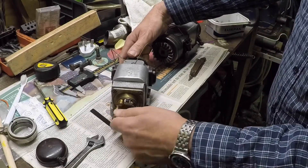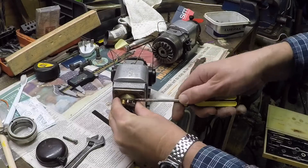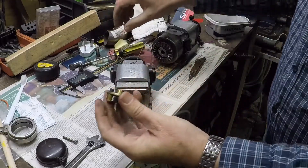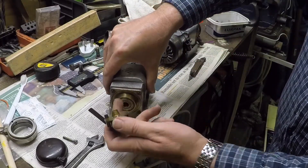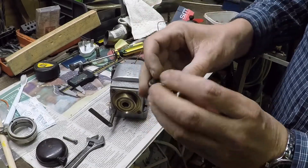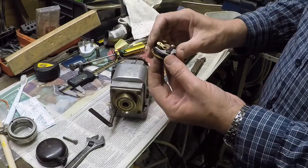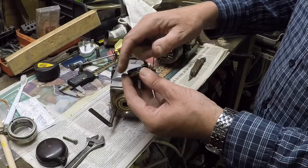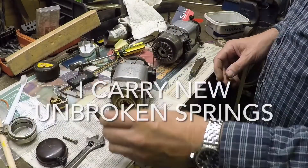You just undo this little centre screw, pop the bolt out, and if you get a screwdriver — a little taper drive — it doesn't need much force, just enough to get behind. There we are — that all rotates. There's the brush that runs on there; the ball race is right behind that. What breaks on these occasionally — very occasionally — is this spring, which is just screwed in at each end. The only failure I've ever had was on the way to Bobham one day: one magneto went dead, I landed, took the end cap off and there was a broken spring. But I carry three spare springs in the aeroplane along with a few little tools — five minutes later it was all fixed. They're really good mags.